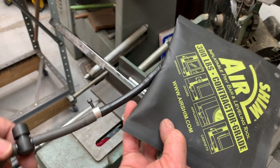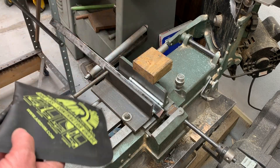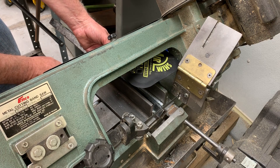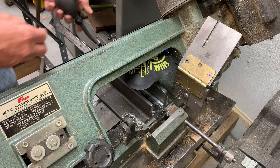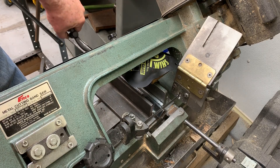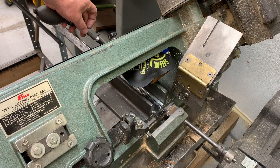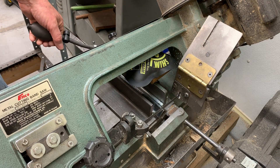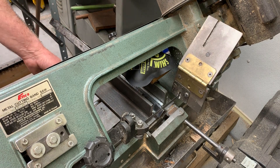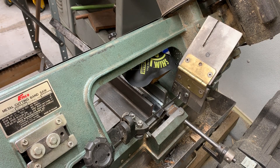That's the whole arrangement, and I've got this real fancy support plate — I may someday pretty that up — and it rests on the fixed jaw. Now what I do is lower the blade down; it's right now touching the stock. Then I squeeze the bulb until the blade clears the stock right there. I've got the set screw already adjusted so it bleeds at about the right rate. I'm going to get this started — you can see how it's cutting — and you can hear the intermittent cutting, which tells you how slowly this is coming down.